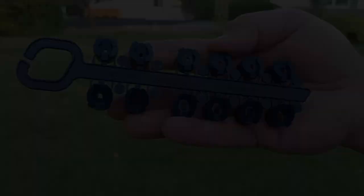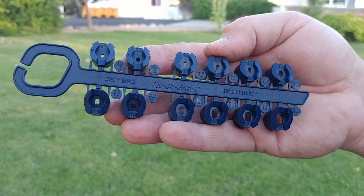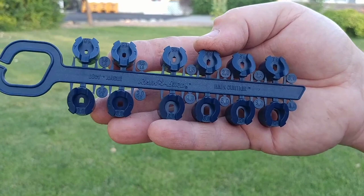As you go to the right side of the nozzle set you will see it says Rain Curtain. There's a whole set of different nozzles there with their accompanying buttons. Reading across the top you've got one-and-a-half, two, two-and-a-half, three, four, five, six, and eight gallons per minute, but there is no low-angle option with those. It's a Rain Curtain design, meaning these nozzles are designed to allow water droplets to land both close to the sprinkler head as well as far out.